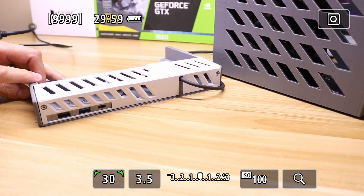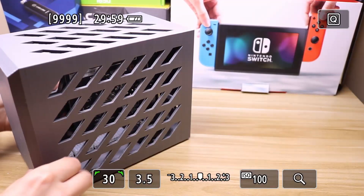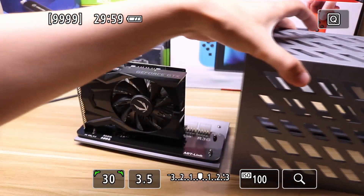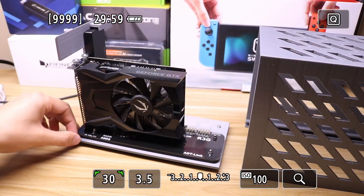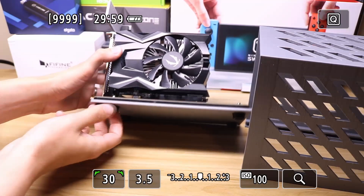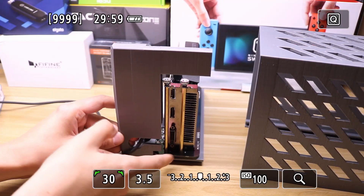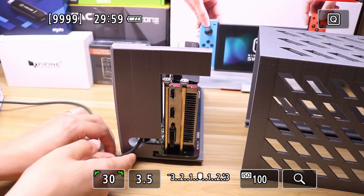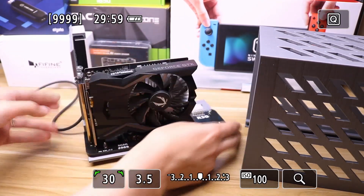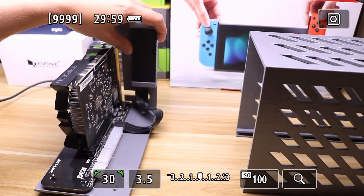Here is the eGPU case. This took about 50 hours to print in total between the two parts. I have a sliding mechanism built into this one, but I will be revising it because it is not reliable — I'll be switching over to mounting hardware. I have through holes located to mount the feet provided with the adapter board. On the back we have a window to attach all of your video cables to your GPU, and I have a slot located here so you can run power cables in and the Thunderbolt 3 cable out. On the back side there's also a little slot to mount the Thunderbolt 3 to M.2 adapter box.